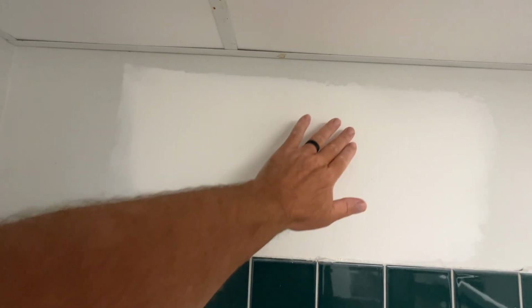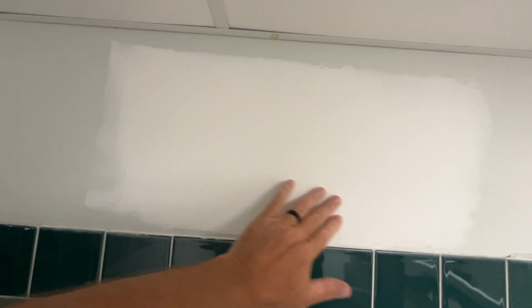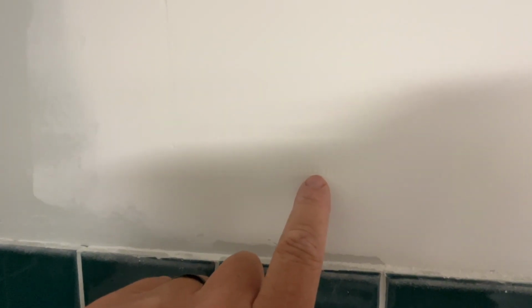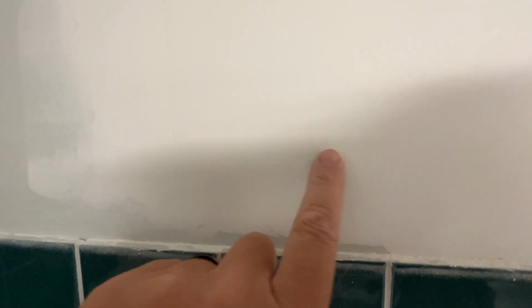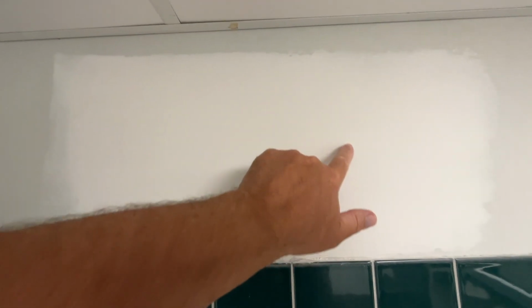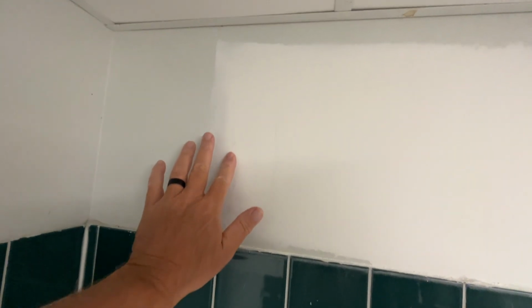But you know, I'm not a fan of this mud. It came out of the tub way too wet. It does bubble and it shrinks, which is too bad. It might not show up here, but there it is. You see that little, see the fiber tape through there. There are some tiny little grooves around the edge, these little bubble pits in here, and just a couple little small things here.